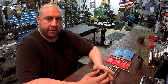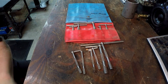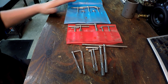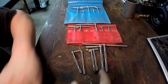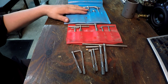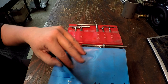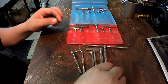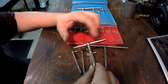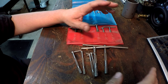Let's move the camera down here and talk about this for just a minute before we go into techniques. There are basically two types of telescoping gauges. This is a set made by General, and then this is your Starrett set — the one you normally see me using. This other set was actually my dad's, passed down to me. Starting with the General set: you have a single-leg style where one leg is fixed and doesn't move, while the other plunges inside it.